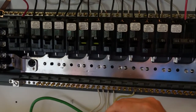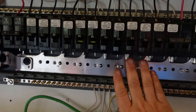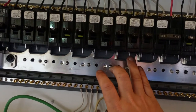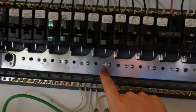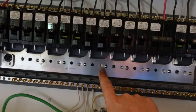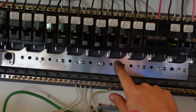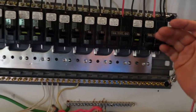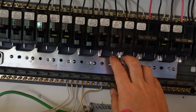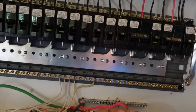What we need to do in this situation is put a two pole breaker in — so rather than a single one, we're going to put a double. The important part is to get that across two bus bars. These bus bars come down the whole one side and go every second one, and then the same from the other side as well. So no matter where you put this breaker, it picks up both sides of the bus bar and balances the load — that's the great thing about new breaker panels.